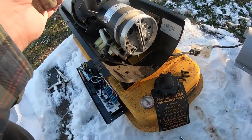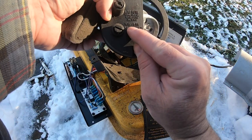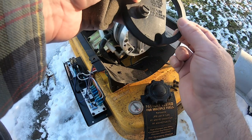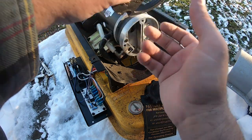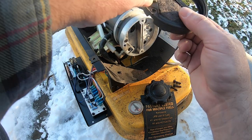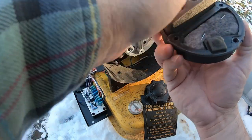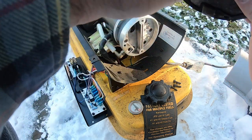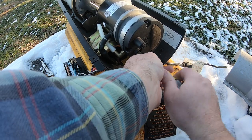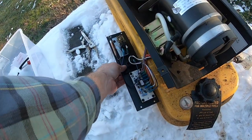This elbow where that hose was goes into here and gets air from here, which is the intake filter. Machine wash and dry every 500 hours is necessary. It don't smell like, oh, this is it right here. Not that big thing. Oh, that looks good. I'm kind of happy with that. I don't think I'm gonna mess with it. I bet that silicone hose lasts more than 2 years. I know it gets hot in there, but those things are good for, I think, 400 degrees. Let's double check and make sure it works before we put the cover on it.